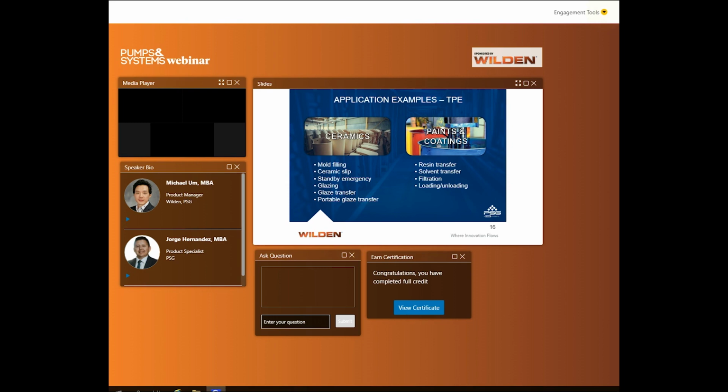So let's explore some applications, and we'll jump in with ceramics. There are many unique stages of ceramic production. Among them are atomizing, electroplating, painting, water treatment, and press filtering, where the pump's ability to have the greatest mean time between failures makes the difference. Santoprene and polyurethane are most commonly used in ceramic applications, with either a traditional diaphragm or an IPD diaphragm. However, it would be best to use an IPD for those high abrasion processes for reliable operation and efficiency.